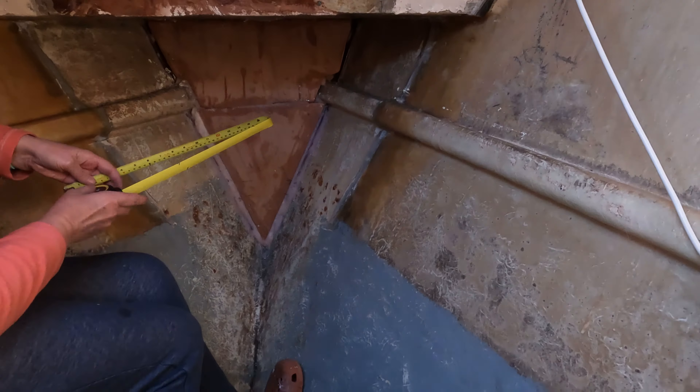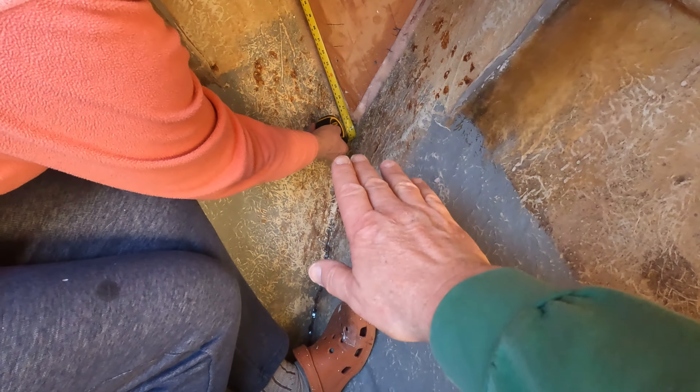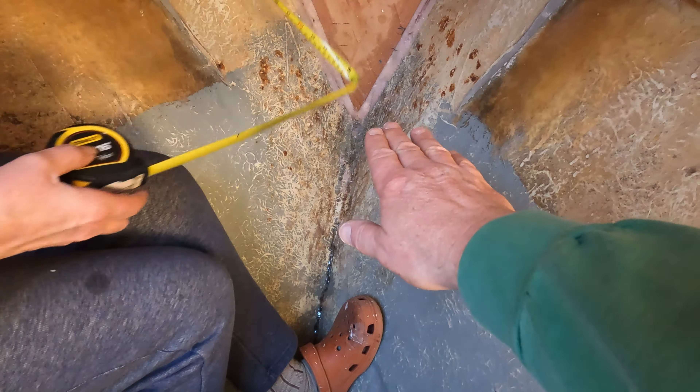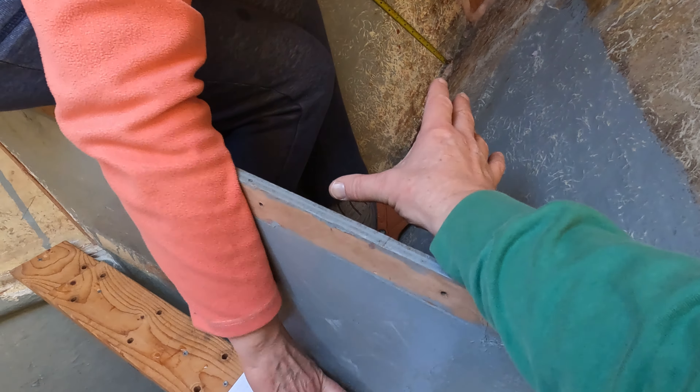While she's been doing that I've been measuring and starting to work out my angles. We're going to put in the top of the waterproof tank to approximately the bottom of that waterproof bulkhead and about 30 centimetres down from the top here, so that we have another fully sealed watertight area above the waterline. That one we'll fill with coke bottles and bits of spare expanded foam from insulation offcuts. That won't be the level of the bed, so there'll be a bit of storage above it when we later put bed boards in.